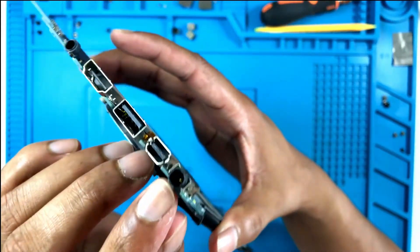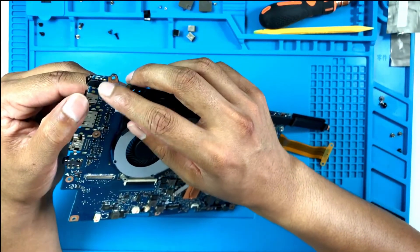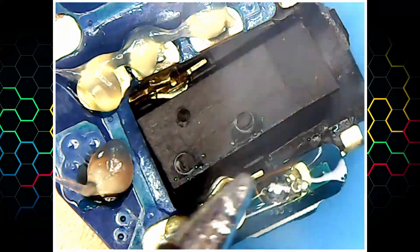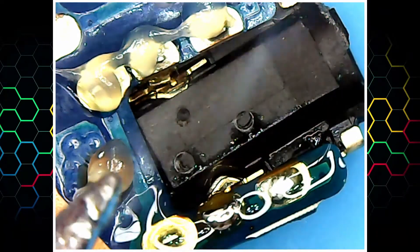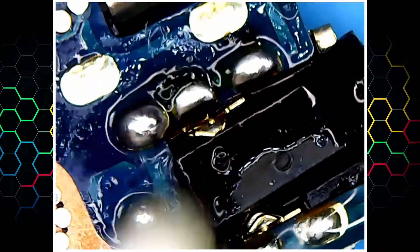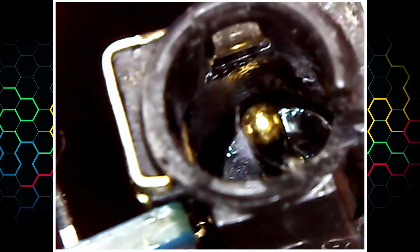That's the charging port — can you see the plastic has broken off around it? This side the plastic is missing. First, what I'm gonna do is add some more solder to these legs and make it a little stronger around the area. Then I'm gonna try and weld the plastic pieces back together — I found the missing piece on the mat. I'll use my soldering iron to weld them back together and then add some hot glue around it to keep it strong.